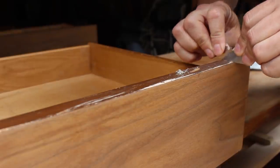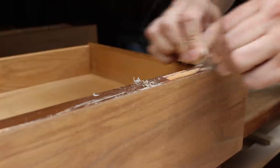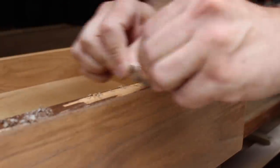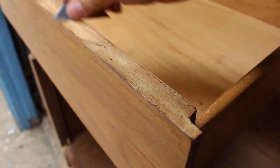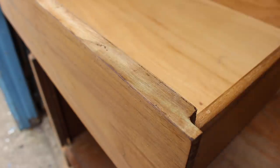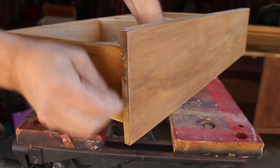On the top and the side of the drawers, I just scraped the finish off. This was quicker than sanding, and if I had used stripper it would have dripped inside the drawer and made a mess. There's no veneer on this part of the drawer, so the finish that they applied at the factory is pretty much opaque so that it hides the lighter wood underneath the veneer. I'll just put some gel stain on here later to darken it up.